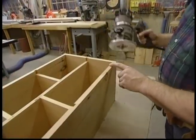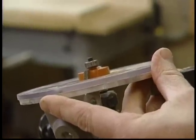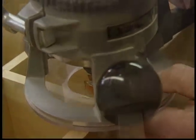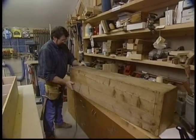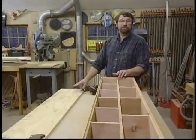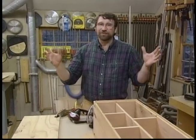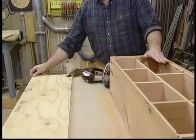With the case unclamped, the next step is to make a rabbet in the ends and the top and bottom pieces. I'm going to use my router set up with a three-eighths inch rabbeting bit and a ball bearing guide. The ball bearing will run on the inside of the cabinet, but as I come along I'll come to these intersecting dados. I don't want the ball bearing to roll into that dado, so I'll use my finger as a guide to keep the router on track as we pass each notch. I've turned the piece around to show the back — the original was made with just a couple boards with no effort to conceal the edges. I'm not only going to conceal the edges but also use plywood, because with plywood I'll get extra strength in the case and I can also hang the piece from the wall with screws into studs — it might be nice in a front hallway for keys or gloves. I need to make one more rabbet in the plywood so it'll overlap the rabbet I already milled in the case. Then I'll just round over the corners to fit the rabbet on the case.